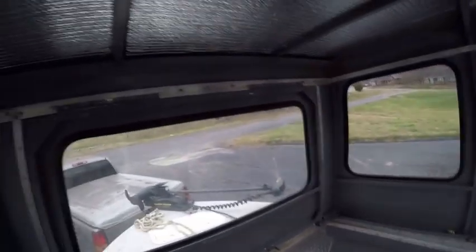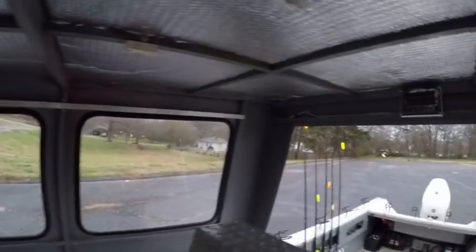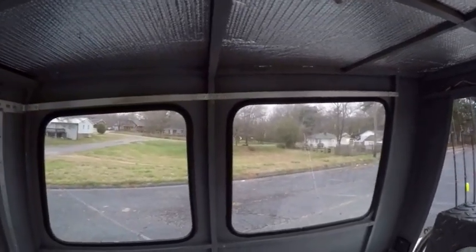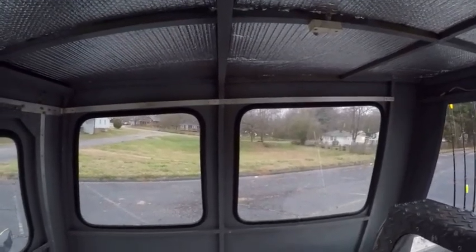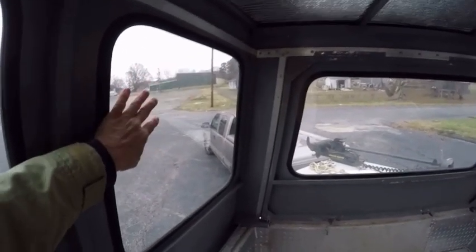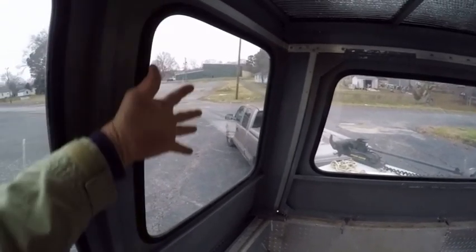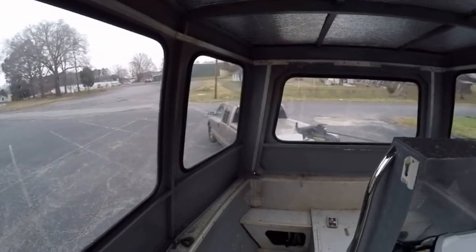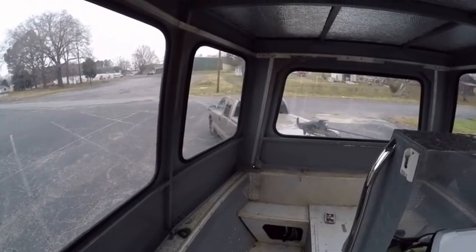Here's the top I've got. It's been several years since I built her and she's held up really, really well. I've added a few things over the years — I added that new bar there just to give it a little more strength to hold the metal straighter where I put regular glass in it. I had plexiglass in it at first — it worked, but plexiglass really yellows, gets scratched up, and doesn't hold up too well. So I went to real glass — 3/16ths inch glass, normal glass, not tempered. But I've got a film on the inside that makes it shatterproof. If you hit it with a hammer the glass will break, but it won't go anywhere — it'll stay intact and won't fall inside the boat. That's why I went with standard glass, and standard glass is about 20% of what tempered would cost.